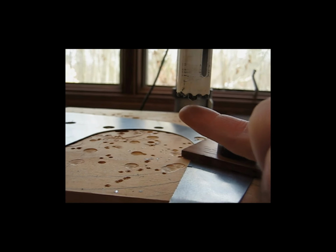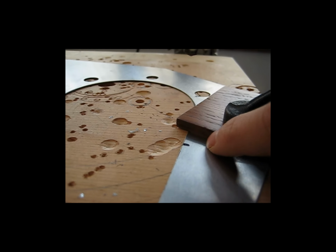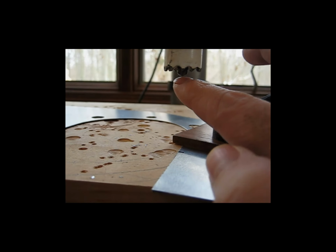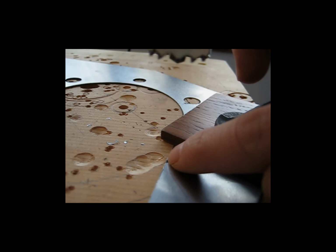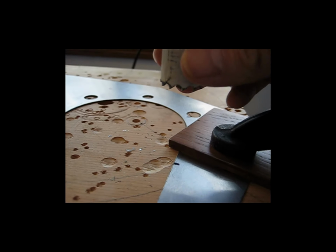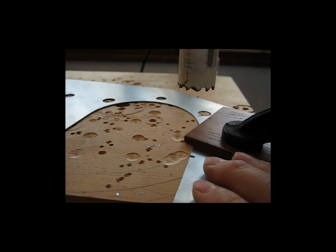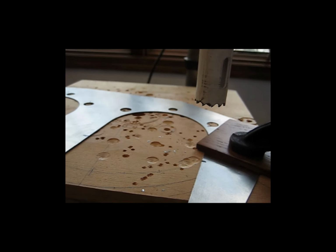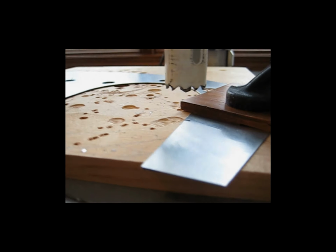So the hole saw tip then here will come down, and it will be right on the edge because I need to cut a half circle. So that the tip of the hole saw drill bit then will come down right on the very edge of the aluminum, and then it will cut that half circle notch that I need. This is a 7/8 inch hole saw. So I've got everything clamped down, secure, and I'll go ahead and I'll run this, and I'll just drop it down right on the edge of the aluminum, and it will cut that half circle.